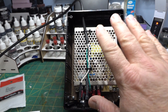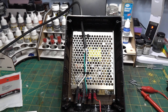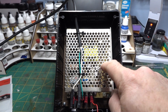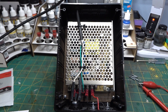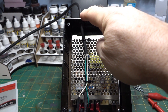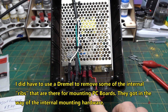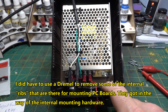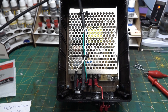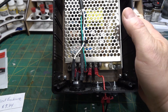There are plenty of rocker choices and you don't have to go illuminated if you don't want to. The case is nice — it comes with an aluminum top cover or a plastic cover, which is the one I used. For the internals, I cut a micarta board to mount to the standoffs below using number-4 hardware to screw the power supply down so it's not sliding around inside the box. I drilled holes for the rocker, a quarter-inch grommet in the back as a strain relief for the power cord, a two-point terminal board, and the hole for the output wires. I used number-18 wire inside.